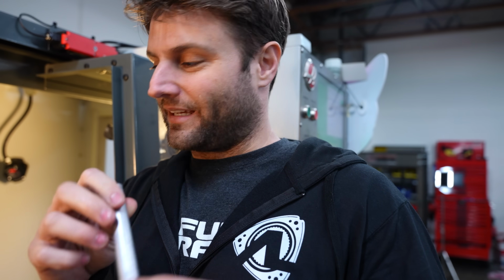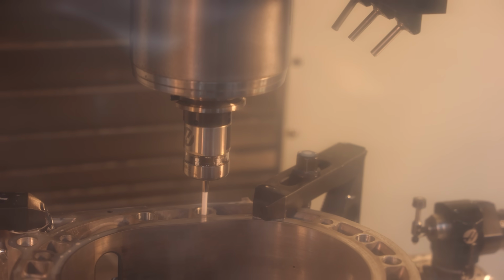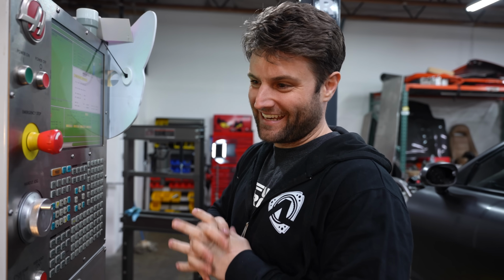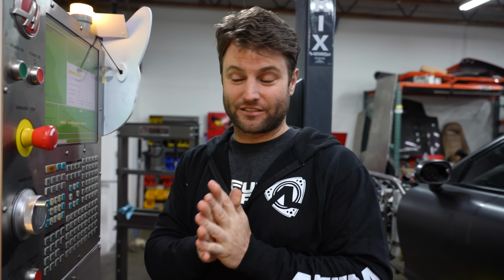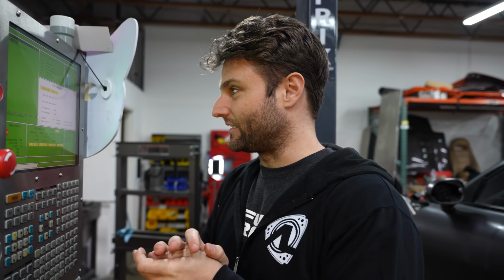The hole size is one thing, but then see if it fits up with the motor. I'm gonna guess 0.6307. 0.6305. Wow. We hit within the range of Mazda's factory dowels, slightly above it, and first time doing that. We're within the range of the existing engine from the guys out in New Zealand, which was 0.6304 to 0.6308. So we hit 0.6305. Let's pull it out and compare it to the motor.